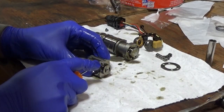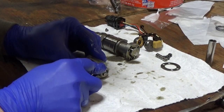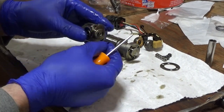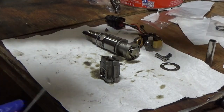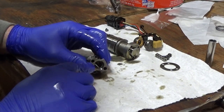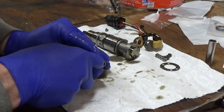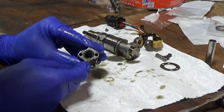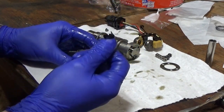Start taking more O-rings off. This O-ring right here is usually rock hard — I usually just take a pick and end up kind of cutting it to get it off there. The O-ring that's known to fail at the oil rail — where the little nipple from the high pressure oil rail goes into — I just take a pick and force it in there. A lot of times this one breaks too. There it broke — grab it and pull it out just like that.